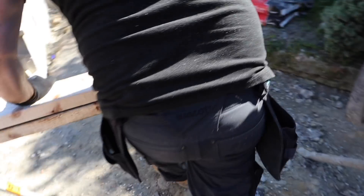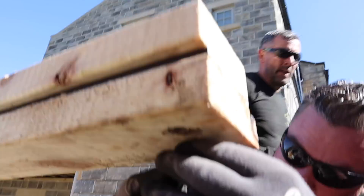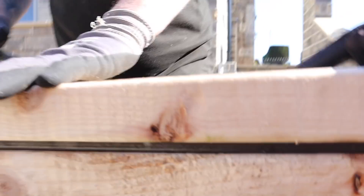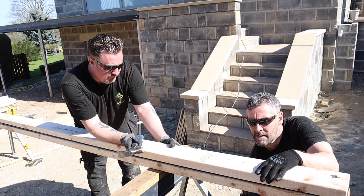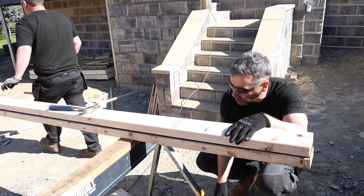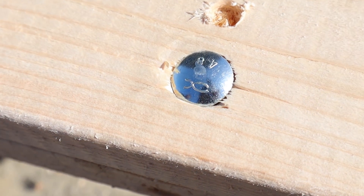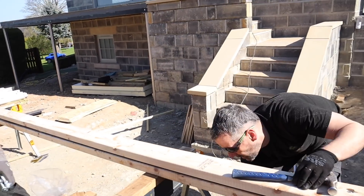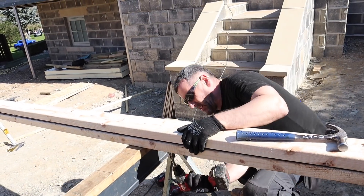Adam's going to drop down — we've got these M10 bolts. Once he's got that through, we'll use the impact driver on that. You can see it's pulled that in and clamped it tight. I'll go down the timber and drill through all the holes, making sure the timbers are flush with each other. When I tighten that up with the impact driver it pulls the coach bolt into the wood, nice and tight.